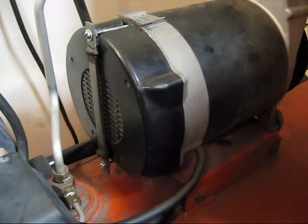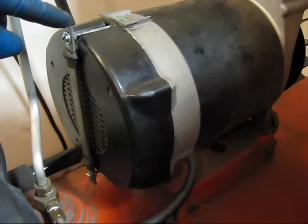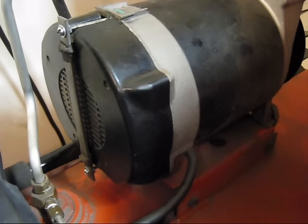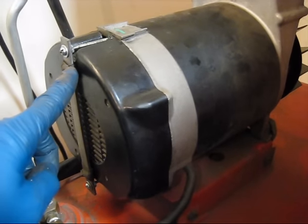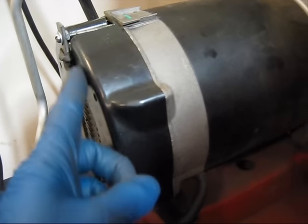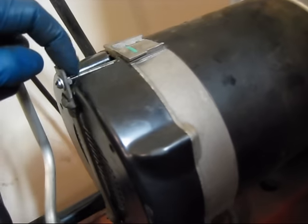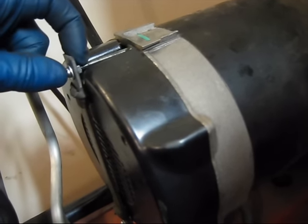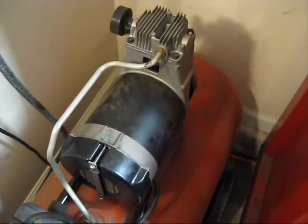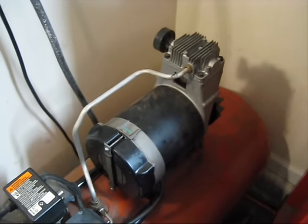I've got my new rear cover retainer in place — it's just threaded into the existing holes with some longer screws. I did have to tap the holes out a bit with a tap because the original screws were self-tappers and didn't make very good threads, and I needed it threaded a little bit deeper than before. We've got a little bit of rubber inner tube here and here just to space it out from the cover a little bit and provide some cushion, because this cover is not entirely flat — it's got a bit of a curve to it, and we want that to sit flat. On the back sides of the screws, we have nuts to clamp down to the head so the screws do not turn and loosen up from vibration. I'm going to go ahead and flip it on — it should start up. And it hasn't gotten any quieter in that time, but that should take care of the problem. Now I just got to put the shroud back on.